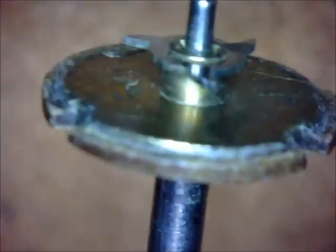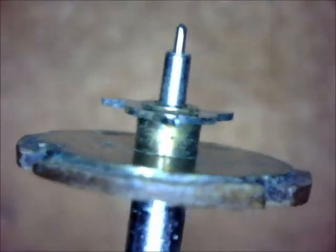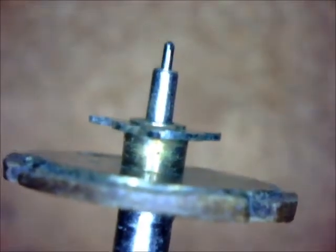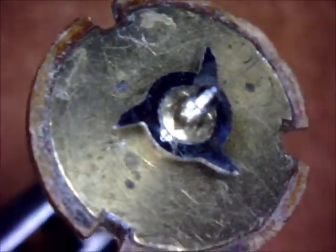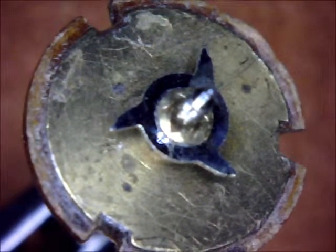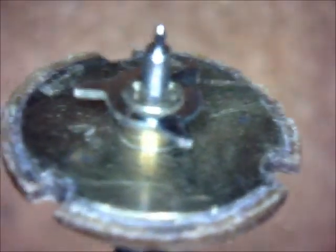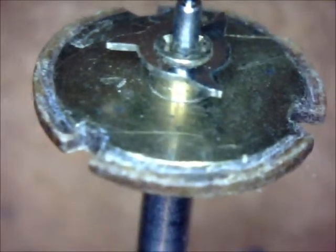The diameter is 6.460mm and the notches are exactly the same size as the original. It's all just pressed back together. I've got the staff in the middle of this one now so you can see what it looks like assembled. The thickness can be a little more or less, but the diameter must be dead on 6.46mm. And there it is, ready to roll.